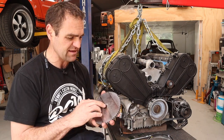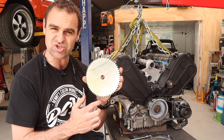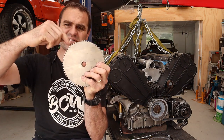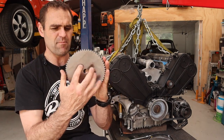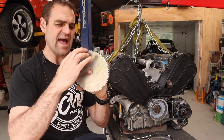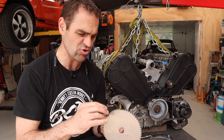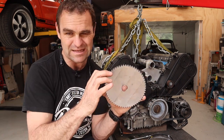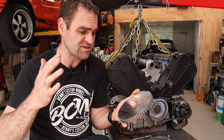What I'm going to do - I contacted Raceworks and they sent me this, which I think is a 60-minus-two tooth wheel. Basically there are 60 teeth around this, but you can see there's a gap where a couple are missing. There'll be a sensor that picks up where the tooth is, and as the wheel spins the sensor picks up every single tooth and recognises the gap. That's top dead center, or 20 degrees before TDC - whatever, it can all be programmed in. It's just a reference point so the computer knows exactly what's happening.